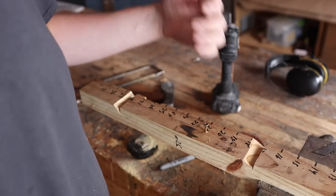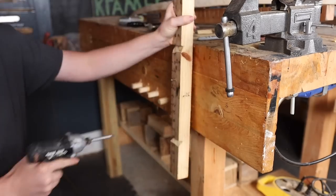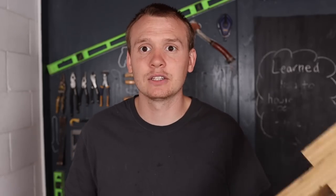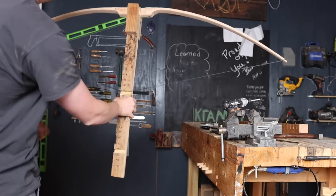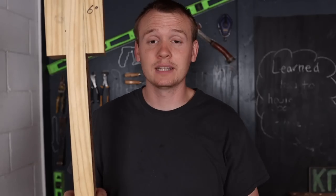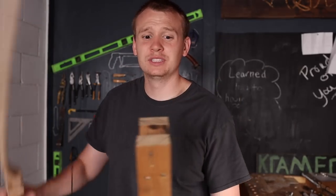Another option is to pre-drill holes and use a wooden dowel, moving it up and down depending on where you want to draw the bow. For mounting, you can screw it to a workbench, use a work vise, or just set it on the ground with two bricks against it. You can even screw it to a wall stud and use the stud as part of the tillering tree itself. For first-time bow makers, this is what I recommend — it just takes a few pieces of scrap wood or a $3 2x4.